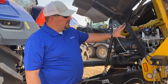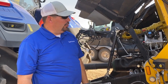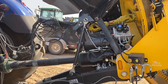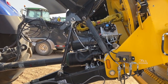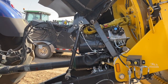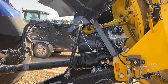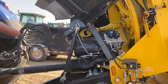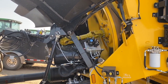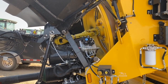I've got this shield removed right now, but make sure you don't do this with the hood open. You'll notice that the PTO starts but the baler hasn't started yet. You have to get the engine up to 850 PTO RPMs, and then it starts. You're going to bust through first gear and then shift into second gear.